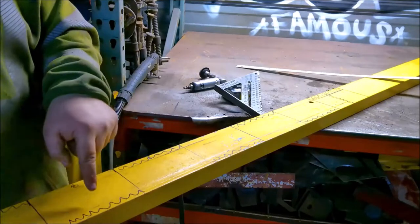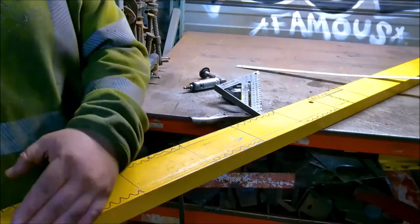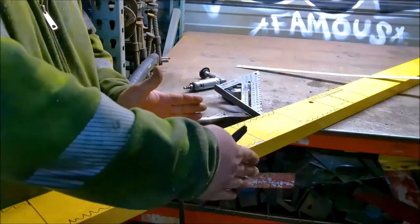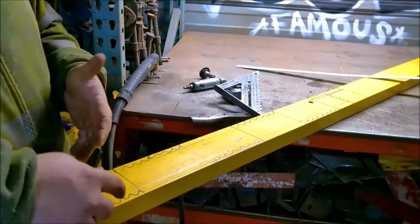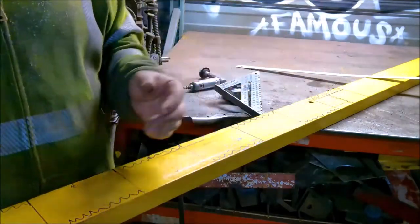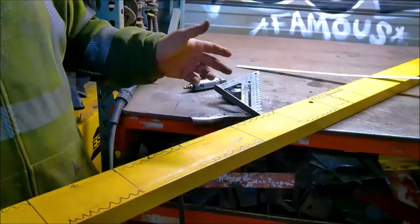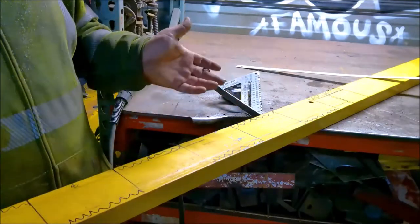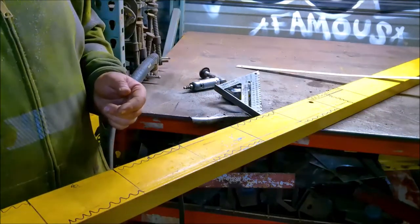There'll be pockets in between each one, so every place I've cut out, so it'll be 6 and a half inches wide, and then there'll be a pocket, and then 6.5-inch, so it'll be like pocket, bar, pocket, bar, pocket. Simple enough, just a simple butt weld, put a nice bevel on it, and maybe we'll add a couple under braces, but I think it's going to be more than strong enough to put a lawnmower on, so let's get to cutting, get to welding.